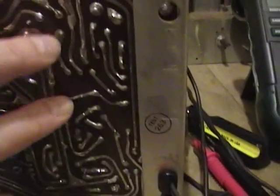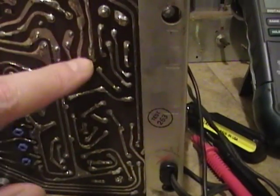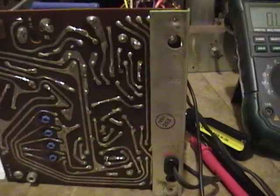It's pretty easy to do because the resistor is on the bottom of the circuit board. I can just tack a few resistors in series, bridge those two points, and try to bring the value down to see if the meter calibrates better.